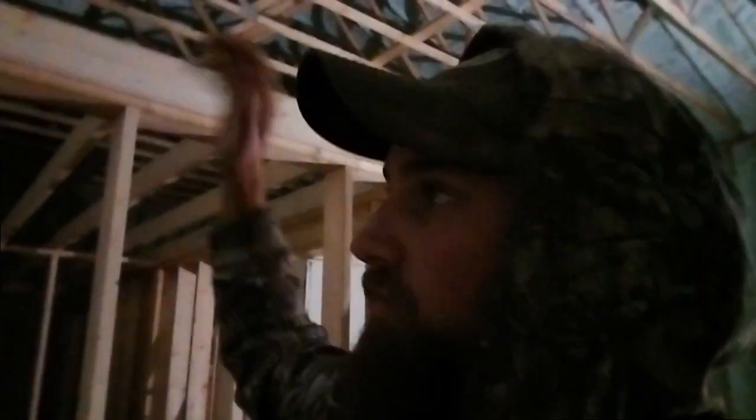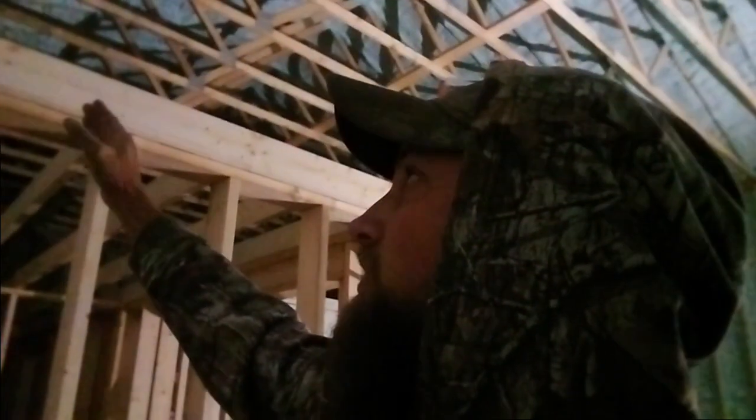The actual end board on that. I brought the joists all the way out to the edge, and I put that on there because they're going to be putting 2x6 purlins on the walls all the way around here for the steel that's running in here. So I just figured I'd save them a step, because if I would have put that flush, they would have had to add another board on top of that to bring it out for their trim work in the steel.